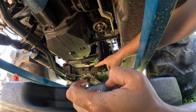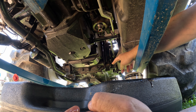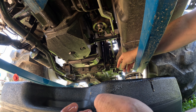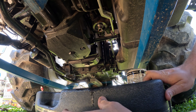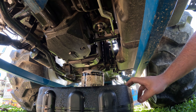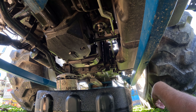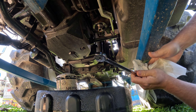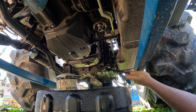Now right back here, you can see this white plug — that's the drain for your rear end. There's another one a little bit beyond it that's kind of covered by your draw bar if your draw bar is pushed all the way in. We're going to crack the two of those open and drain the system. Hopefully there's five or six gallons in there, otherwise we've got a problem with leaks or oil consumption or something. The biggest wrench I've got is this 19mm and I'm here to tell you that ain't going to fit, friends. So I've got to go pick up a bigger one. Always be prepared for the job you're going to do, right?